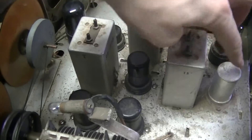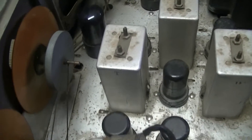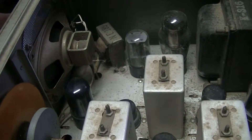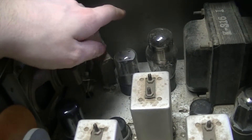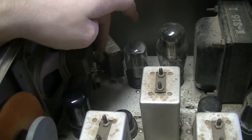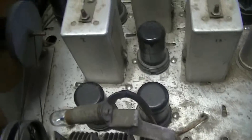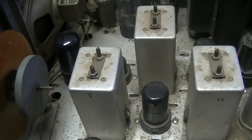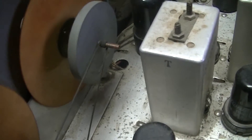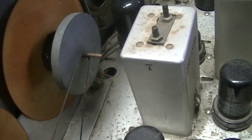That's a capacitor — 10 microfarads. There are intermediate frequency transformers, and obviously not the original speaker since this thing has had some extensive modifications and restoration over the years. There's the impedance matching transformer for the speaker, the main power transformer, an inductor of some sort, a lamp for the dial, the tuning capacitor, and a string drive belt for the band spread mechanism. The band spread dial doesn't want to turn, so that's one thing that's going to need to be worked on.